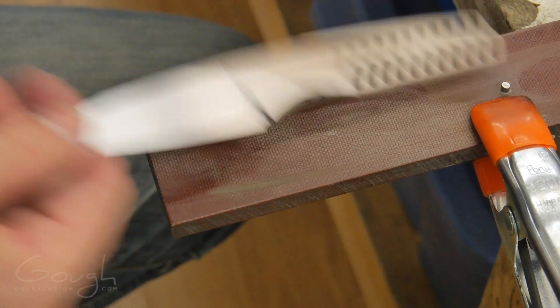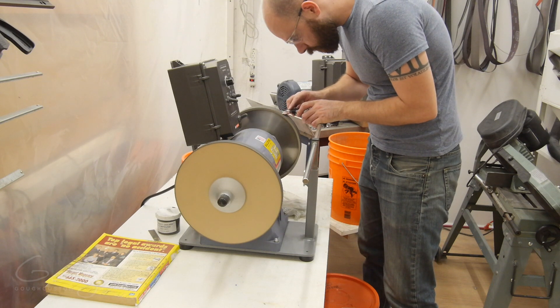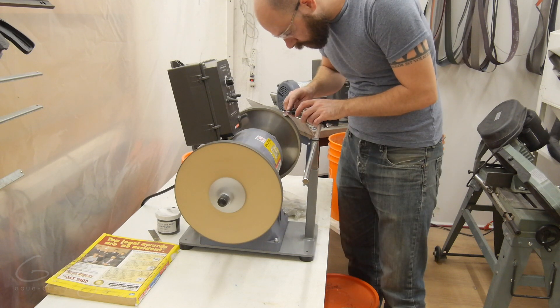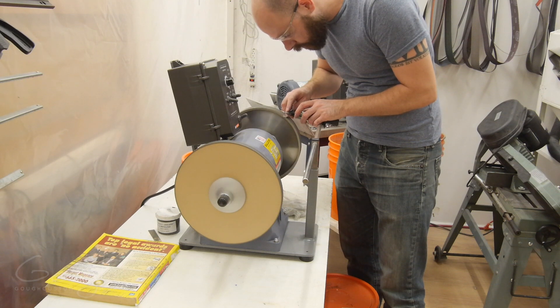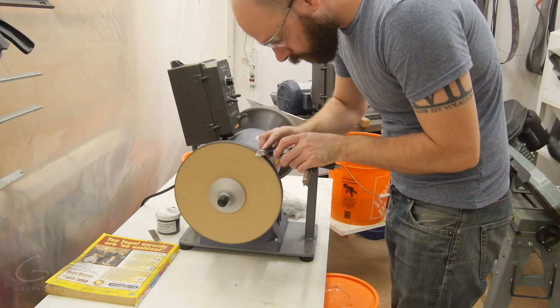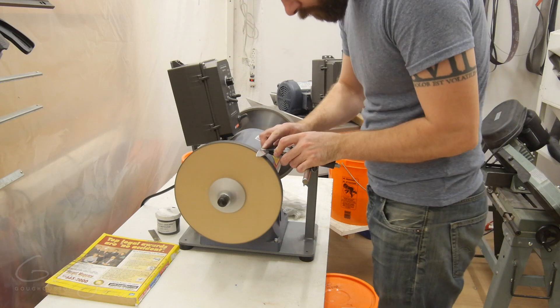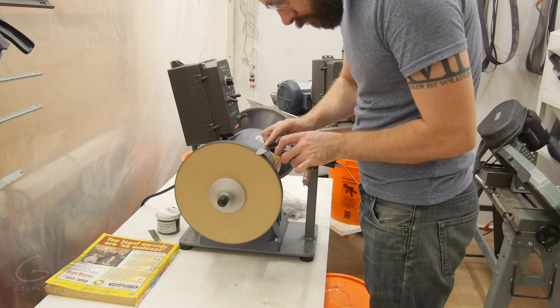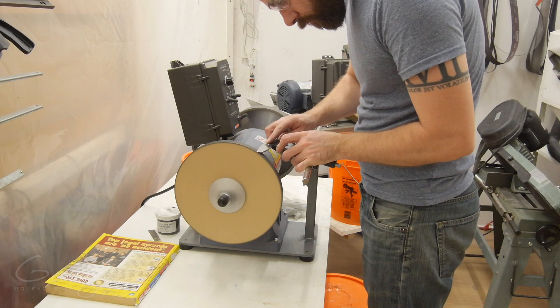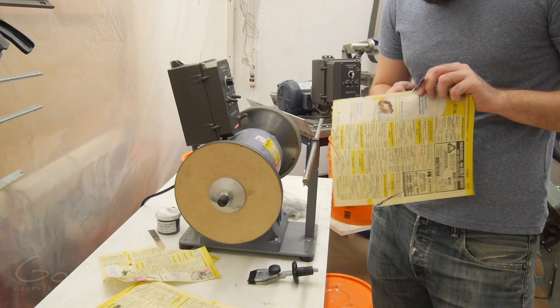The hand finishing is now done, and it's time to move on to sharpening. The sharpening system that I'm using is one I specifically designed for my knives. I roughen the edge with an 800 grit CBN wheel, and then I finish the edge on an MDF strop loaded with 1000 grit CBN paste. This allows me to quickly produce excellent edges without any risk of overheating the steel. You can see that it's terrifyingly sharp, as always.